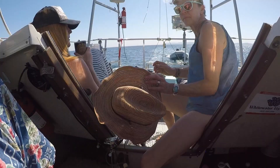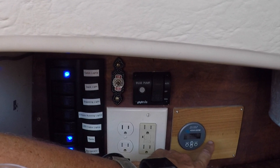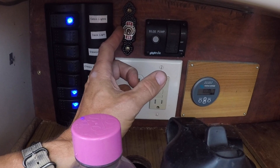Basically I've taken all the electric and put it into the back compartment. I can show you what we have for controls inside the boat: bilge pump, battery monitor, some 110 outlets, cabin lights, deck lights, steaming lights, classic running lights, LED cabin lights, radio, refrigerator, inverter. And then up here is my tricolor on the mast — it's either up for anchor and down for tricolor sailing.